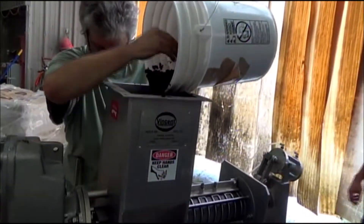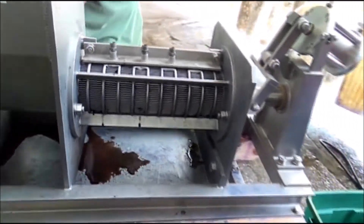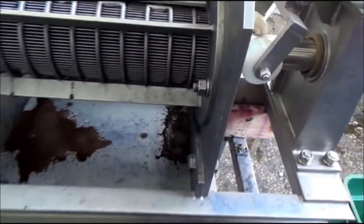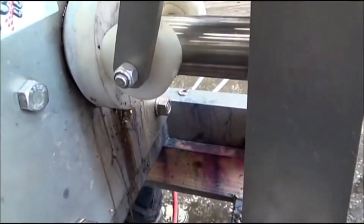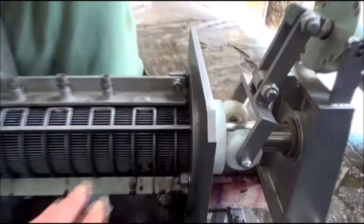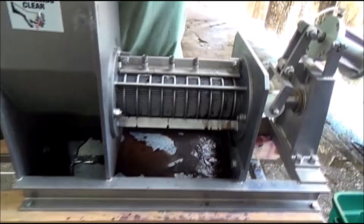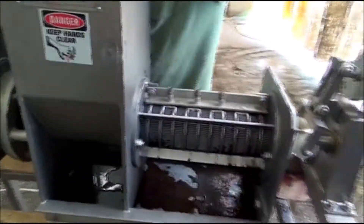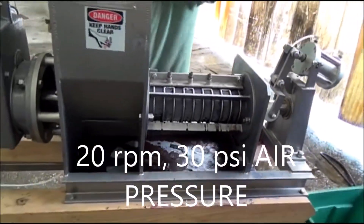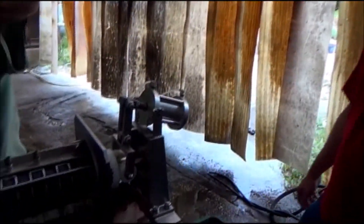We're starting our initial run and we're already getting some free liquid coming out. We've got some all the way down to the end — the cone is shut. I got water running down there; that happens because this material has not been squeezed or compressed, it's just been conveyed. We're running at 20 RPM with 2 bar — 30 PSI air pressure on the air cylinder.